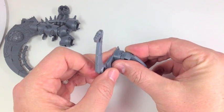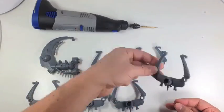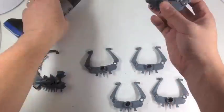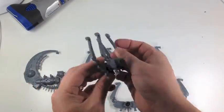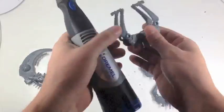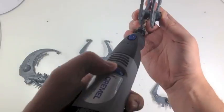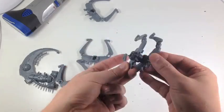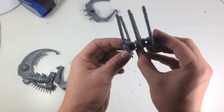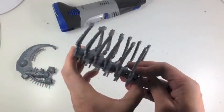This will allow us to flip it up and down and have a magnetic attraction. So here's all the rib pieces - we have them aligned front to back. What we're going to do is hold them together and drill in the holes necessary to put in magnets. We keep adding the pieces that go next, fitting them together and drilling the holes. You want to keep these all together in the same formation just so you can keep track of which ones go where - most importantly the front and back ones, so you know where those little pieces of plastic sprue are glued on for the main magnets to be in the proper places when you put everything together.